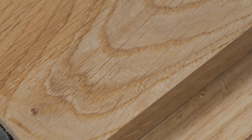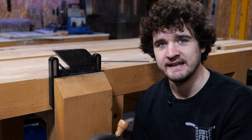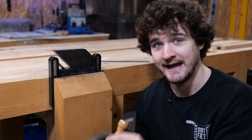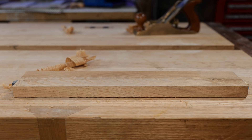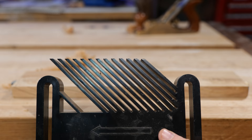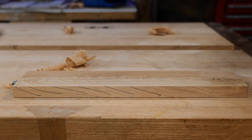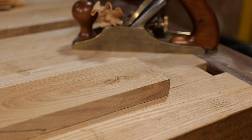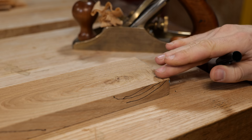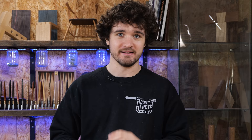That's what all this light discoloration is along this side of the wood — minor tear out. There are patches of proper tear out you can feel, and this would be quite challenging to sand out. Now, how do we predict tear out before it actually happens? In much the same way as we can look at the featherboard and figure out which way to push a ruler, if we look at the side of a piece of wood, the fibers are tracking up towards the top left corner in this orientation — the same direction as the featherboard. Watch what happens to the cloudy area when we plane with the grain. Gone.